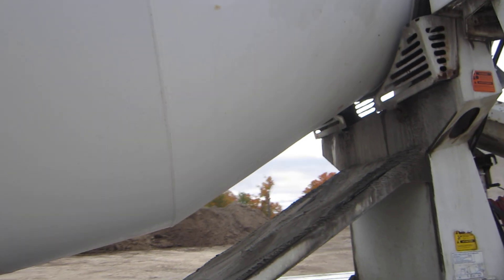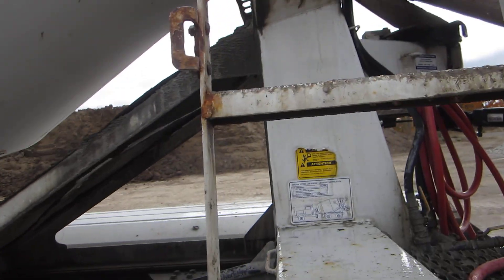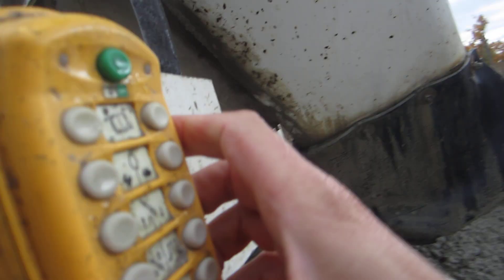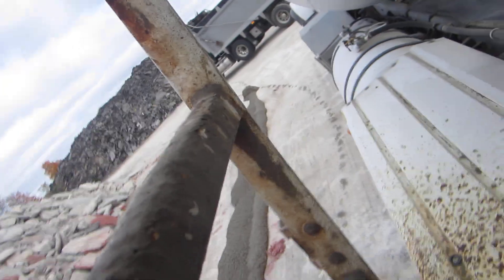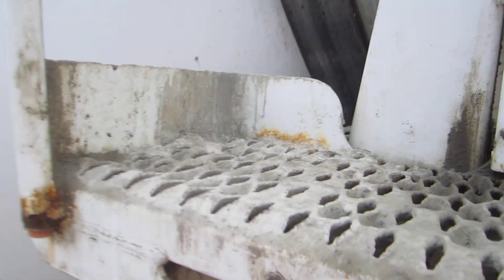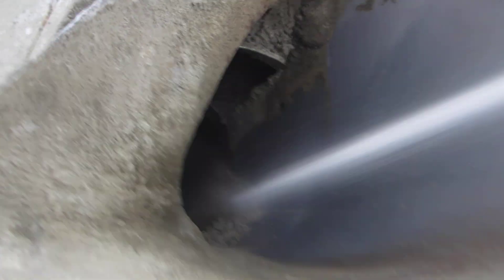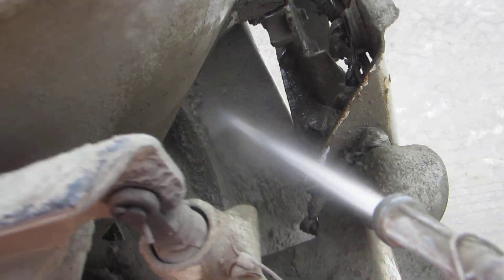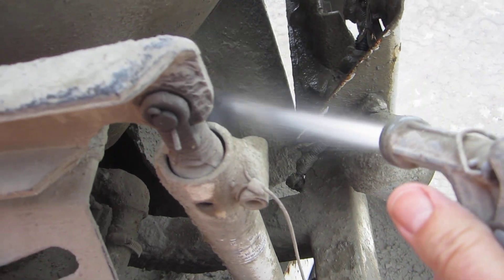Turn the barrel back in. Now when you're cleaning the truck, you do the same thing as when you shower yourself — you start at the top and work your way down. Fly the chute up all the way, and pull it in to the mud right here. Pulls off the chute.